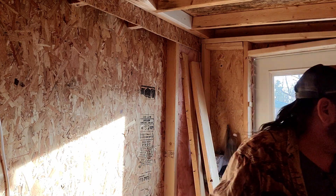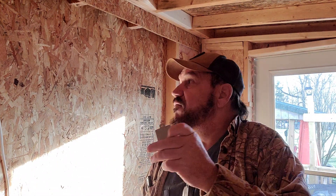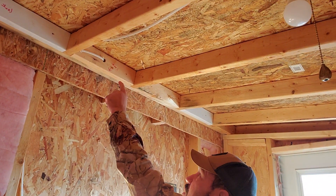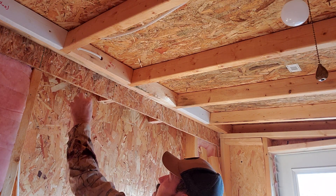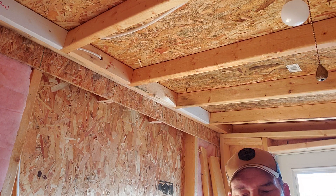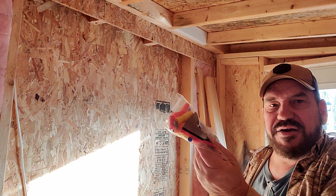I did get some electrical stuff here. I just got some junction boxes. I did get some nail plates. I'll explain to you what a nail plate is later on down the line. If you look up here, you see that I drilled a hole - I always stay right about in the center - a hole for electrical to go through. Even though my screws aren't long enough to reach it, you don't want to take a chance, so you'll hammer these in there and that'll keep you from ever driving a screw through it. I picked up some of them and another junction box.